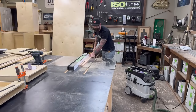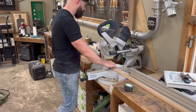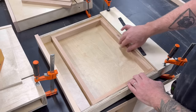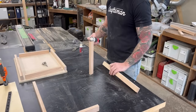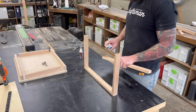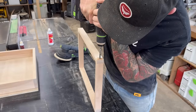I cut down more solid birch to create a frame on the inside of the fold-down lid to catch the secret stuff stored inside. Even though this is the bottom of the top side of the shelf, I'm really building the entire thing upside down. To hook the birch frame together I used CA glue and activator spray to get the frame in the correct shape first, then once everything was CA glued together I could join it more strongly — basically making three very simple birch rectangles.